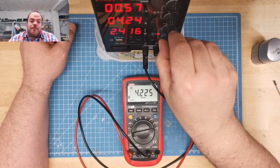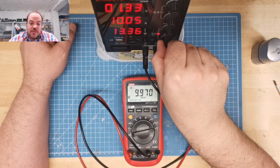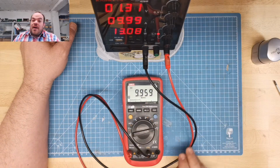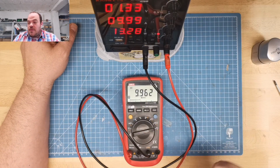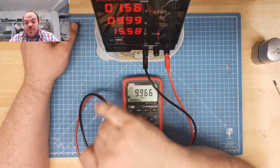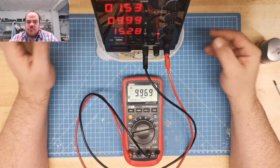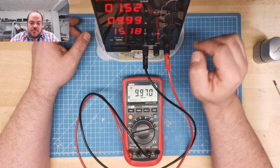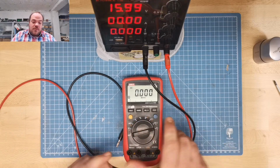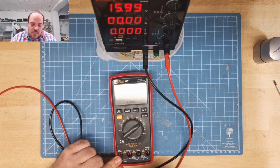So now I can set up the limit. Just go to 10 amp. That is also what the meter can do. And you see at 10 amp what happened. We are already dissipating about 30 watt over the wires and the shunt in the meter. And the reading on the meter, the reading on the power supply tells us we have 9.99 amp and 9.96, so it's a little bit off, but not too bad for the reading here. Let's get another meter. We have enough meters for testing. Oh, maybe I'll make another short circuit. Get this one. Amp.